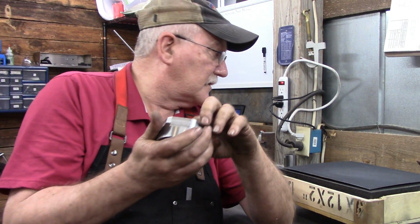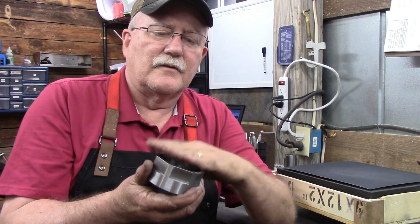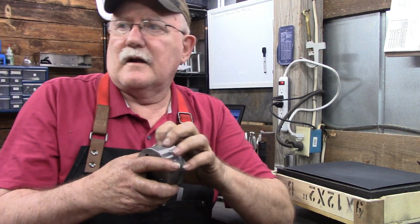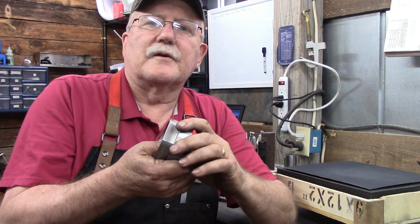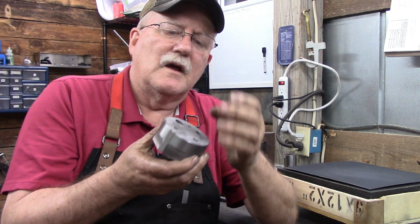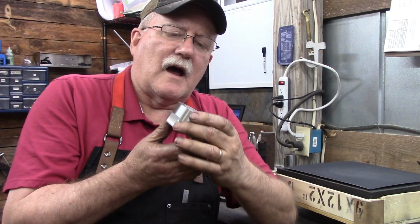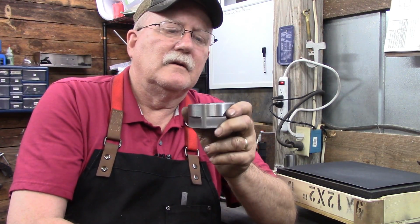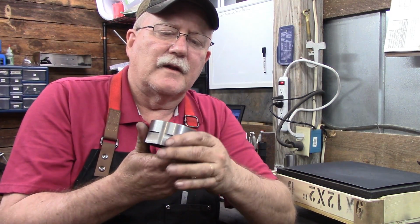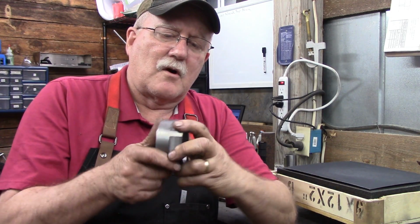Mark's plans call for this to be heat treated and two ground surfaces, this surface and this surface to be ground. I've got an oven, but the oven will only get up to about 1200 degrees, and that's not enough. From what I can read, this needs to go up to at least about 1,600. As I said at the beginning of this, I accidentally bought pre-hardened 4140. Now, I don't know whether that means just the surface was hardened. I do know that it was very hard material drilling and boring that out. So, Mark, I hope you'll forgive me